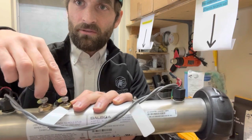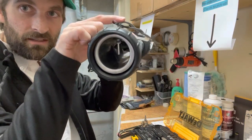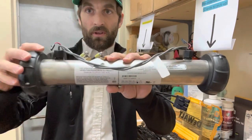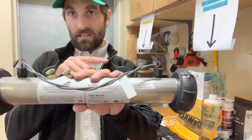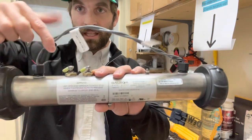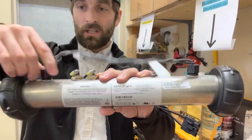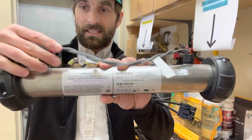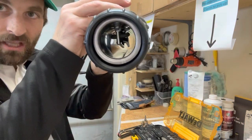If you're changing the element, this one has a sensor that's in the way. So when it's in the hot tub, you might have to decide which side the element is easiest to come in or out — all hot tubs are different. But if it is anything like this one where you have a sensor on one side, you want to make sure that you remove that sensor because it will be in the way when you try to pull out the element.